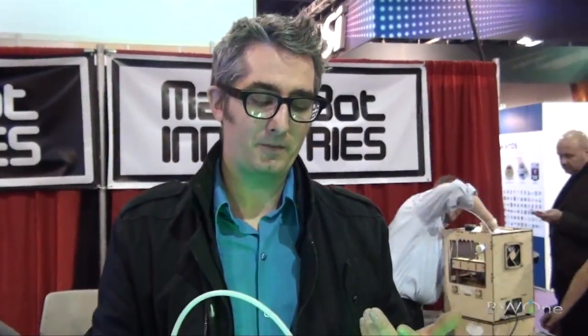What is the print time? It kind of depends on how big the thing is and how dense it is. If it's really big, it could take a few hours. If it's really small, it could take a few minutes. You can also choose how dense you want it to be. You could make a bottle opener and make it so it's totally hollow — it would be a little bit fragile but really fast. You could also crank it up to like 50% full and it'll get filled with honeycomb, so it'll be structurally sound but you can save on plastic.